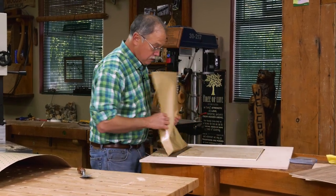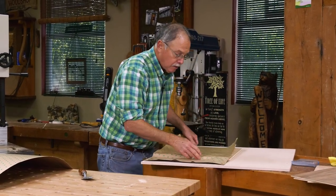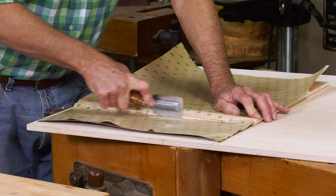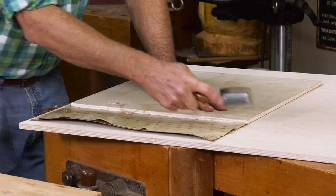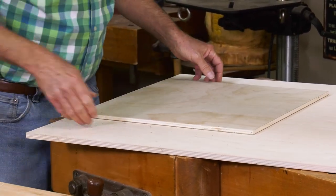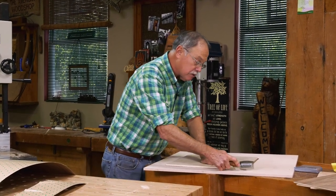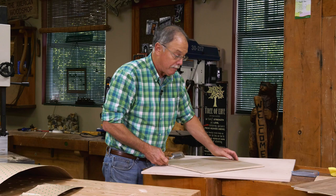Now I can do the other cut — that's flush, just a little bit of sanding there. Everybody has a different way of doing it, but I don't like to waste any of the veneer. Some folks like to use scissors to pre-cut the veneer sheets, but the problem with that is you're wasting very valuable veneer — this is a little bit pricey, especially when you buy it with the peel and stick. So I want to get the most out of it that I can. That's all there is to it. I'll trim this off the rest of the way, and once I get all the panels veneered, it's over to the table saw to cut out more plywood and prep all the other work pieces.